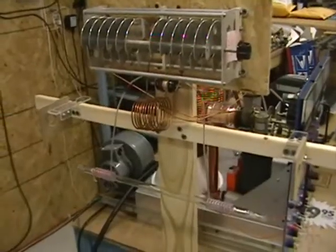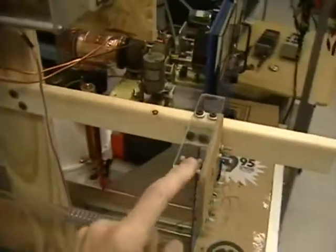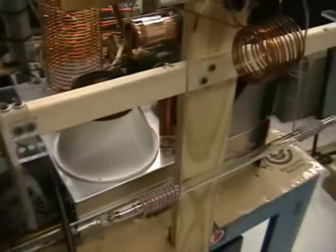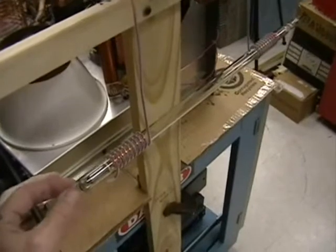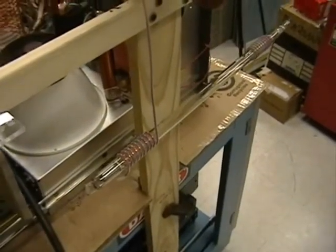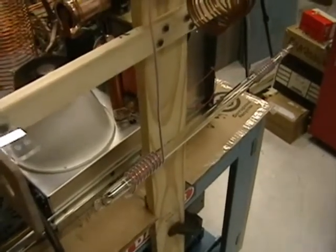Because this is an experimental setup, you'll see such things as tube mounting holders with plastic parts designed to hold ignition wires and other features for use with different types of tubes. In this particular case, this tube is light enough that it's simply held by the wires which feed RF to it, supporting the tube and allowing it to be adjusted at the same time.